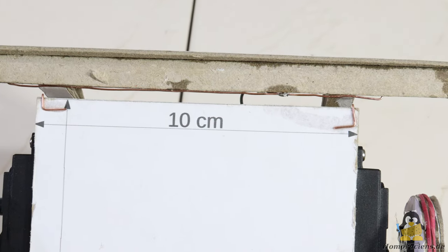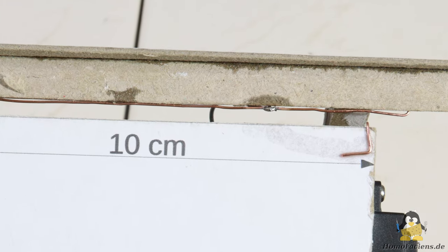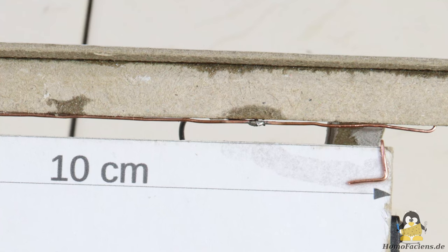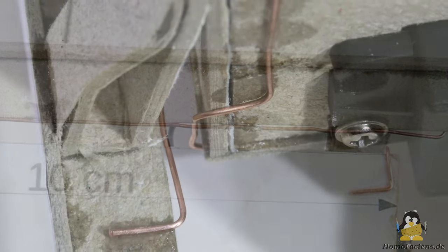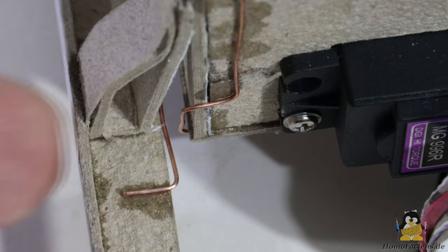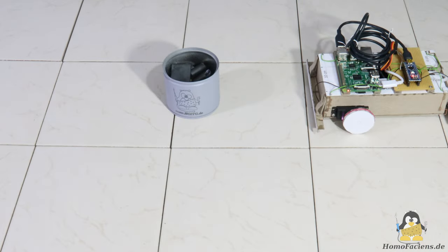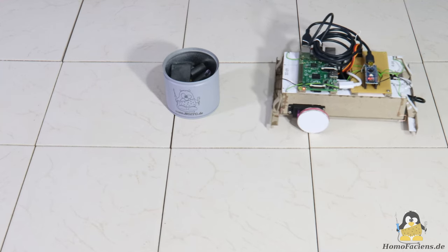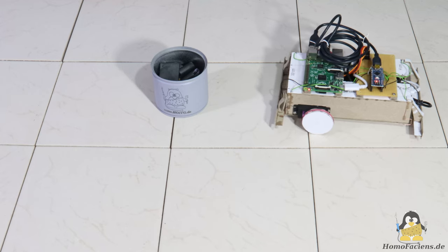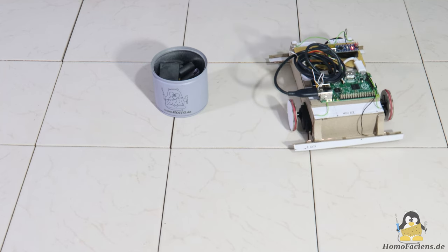As with the 3D-printed Rover R20, there is room for expansion. As the first upgrade I give the robot bumpers with switches that can be used to detect whether the rover has hit an obstacle. On the backside of the cardboard bumpers is a wire connected to ground; at the corners of the chassis are the wire counterparts that lead to GPIO pins of the microcontroller. These simple switches are closed as soon as the rover hits an obstacle. If the robot is fed with the appropriate code, the drive motors will stop as soon as an obstacle is touched. Further code lines ensure that the rover drives back a bit, turns to the left, and thus drives around the obstacle.